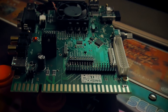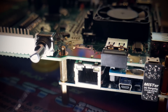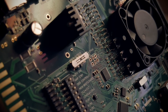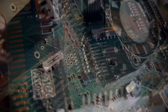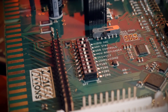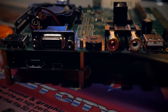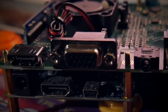While we're looking at the board, there are a few other things to call out. You do have inputs to use either a CPS1 or CPS2 kick harness. Next to that is your volume control, and a little farther down is a USB port — you can see I have my wireless keyboard dongle connected to it. More towards the center we also have the standard reset, user, and on-screen display buttons. There's also a series of 10 switches that are parallel to those three; I'm not going to go through all of these, but their functions are listed in a table I'll link in the description. On the other long side of the board we have a host of output options starting with USB that is power only, two options for audio output, a VGA connector, and at the very end your SNAC connection option.